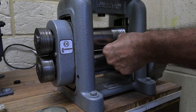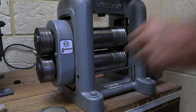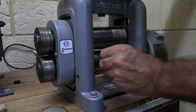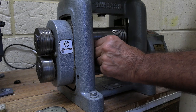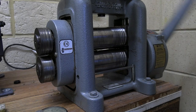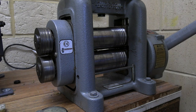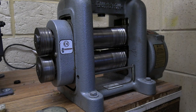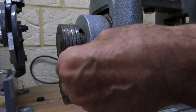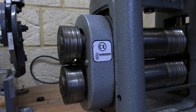I'll just do the same 90-degree turn and I'm happy with that now. I'll open the rolls up and squeeze it onto the middle of the ring and just roll up again to the black mark. You'll feel the roll just tension up as you get to that black mark because it is thicker there, and you'll see that it's taken on a flat profile. I'll tighten it up a little bit more — I haven't annealed it so it is getting a little bit tough, so once I've done this I will anneal it.